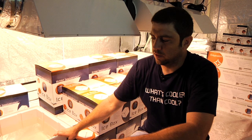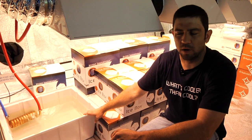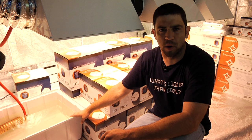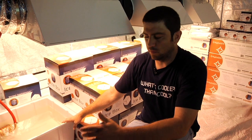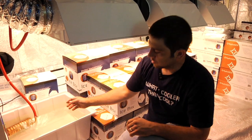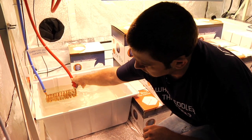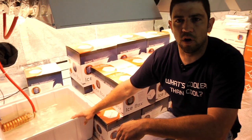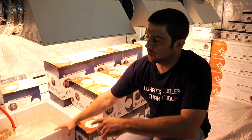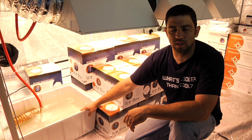A lot of us use chillers to cool our nutrient reservoirs because we all know that higher temperatures are bad for the root system on hydroponic setups. So this system — we're showing you how to do one chiller, one pump, one reservoir. And this is the component here — a coil draped in the reservoir — that's going to take care of all your cooling needs for that as well. You can adjust the temperature of this water by adjusting the valve on the intake manifold.